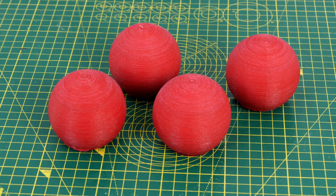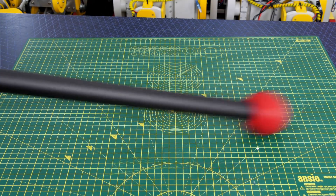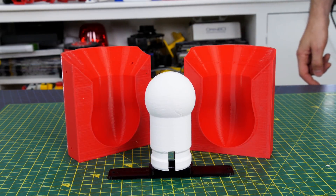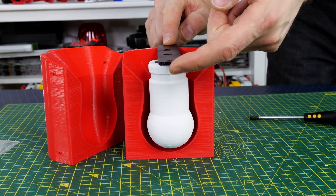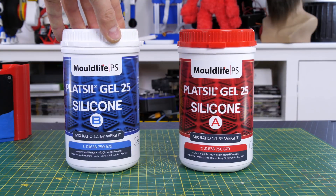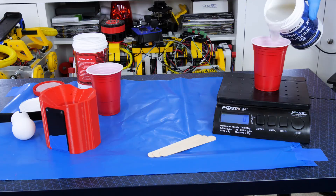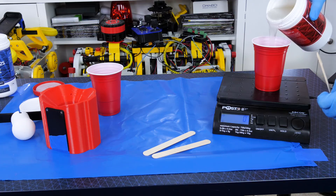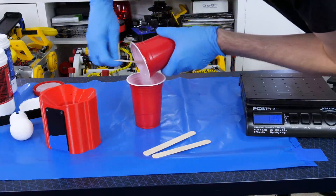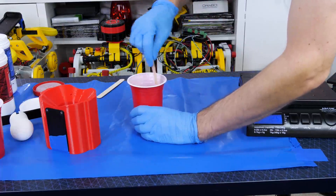I also upgraded the feet — they originally printed in TPU but that's quite slippery and the feet move quite quickly now, which made it slip on a smooth surface. So I decided to have a go at making some silicone rubber feet in a 3D printed mould. I've got a mould core which will stay inside the rubber foot when it's made, fitting inside the middle of the mould suspended a bit like an Easter egg mould. I'm using 25A Shore Hardness Platinum Cure Silicone which is an AB mix, and I also originally bought red pigment to match the aesthetics of the robot. This is mixed by weight with equal parts of A and B, mixed in cups with a mixing stick. It's important that it's mixed properly — the best thing to do is pour it into another cup, scraping out what you can and mixing it again.